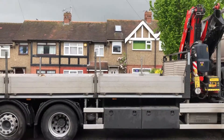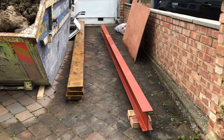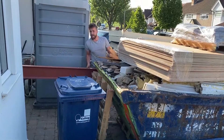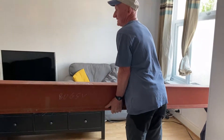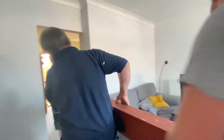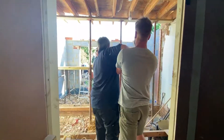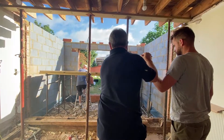Everything's ready — it's now time to put the steel in place. This is the truck that brought the steel; it's got a winch lift crane on the side and this is the steel itself. It's about five meters long, not particularly heavy, relatively thin — it's a four man lift and we're going to have to carry this all the way through the house. We're feeding it here through the living room window and then literally carrying it through to the back of the extension. We're dealing with the usual health and safety issues but we also have to be careful because this is the homeowner's living room and kitchen so we don't want to accidentally damage any of the existing property. We'll rest it on the lift platform to position where we're going to put the steel and then feed it into position.